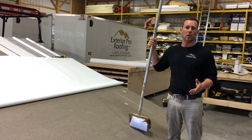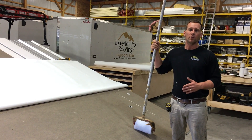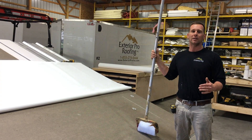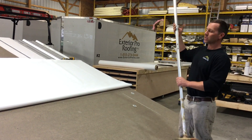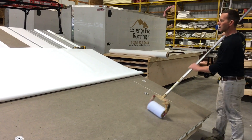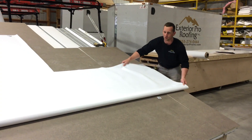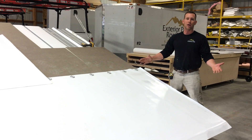One is fully adhered, which means glued down — we're going to take glue and glue something down. The other is mechanically attached, which means we're going to use screws and plates. Most people understand the idea of gluing a rubberized roofing membrane down. Here I've got a big roller, you dunk it in glue, spread it out, then take your flat roofing membrane and feather it into the glue, roll it out, and it's stuck down.